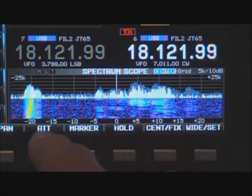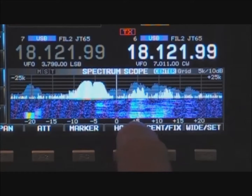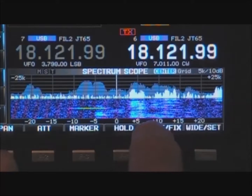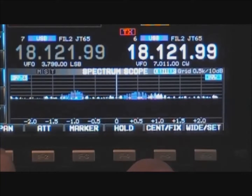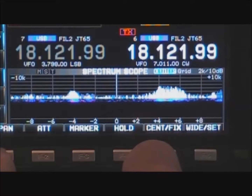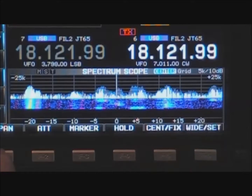It then shows you how far off the center frequency you can tune your transmit frequency, and you can change the span. This is plus 5 kHz, plus 10 kHz — I can push this button and change it: 10, 20, 30, 40, 60. You want to pick a range that's going to include most of the area that station is listening in. So let's start here in the 5, 10, and 15 kHz span.